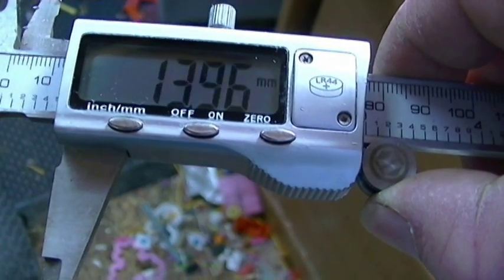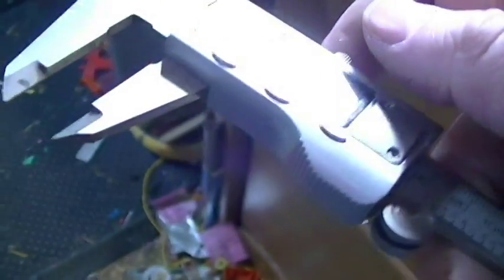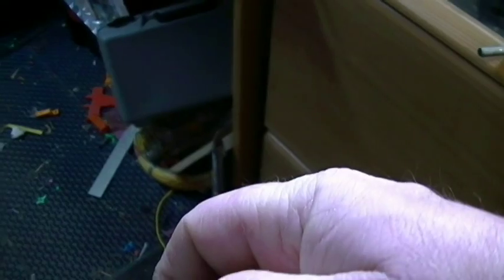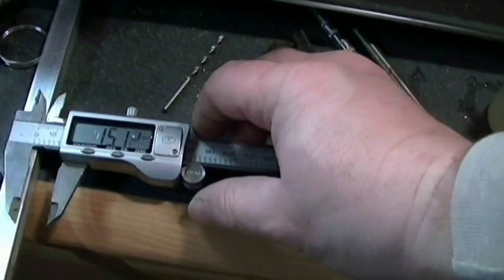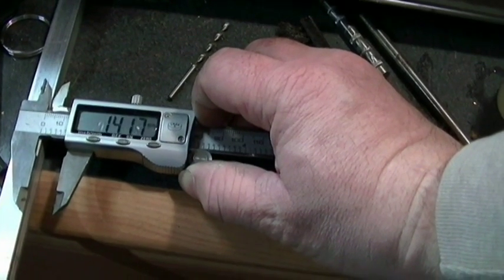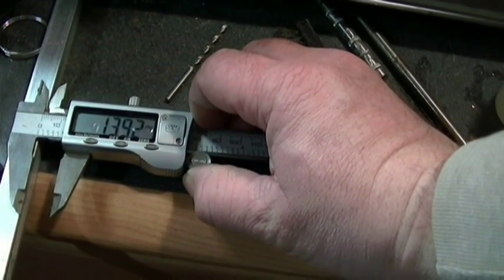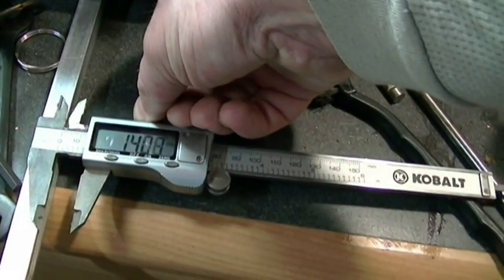Now the specs say that it needs to be 8 millimeters thick with a 12 millimeter by 14 millimeter block. Now, half inch is about 12 and a quarter, 12 and a half, I think it's 12 and a quarter. For the thickness, so half inch is just fine for the width. So here I'm marking my 14.